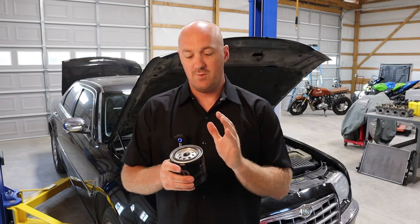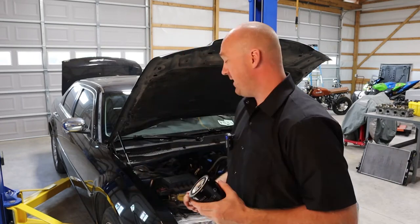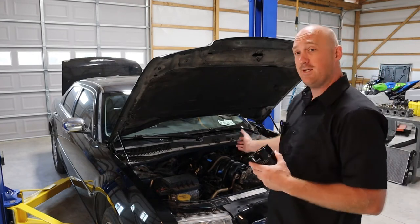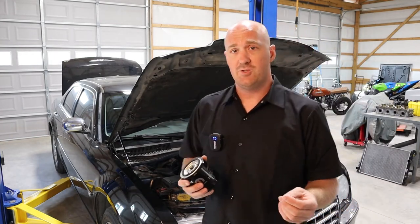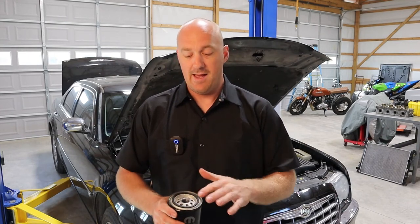The situation when you do need to add oil to this seal is if it's going against a completely dry machine surface. Take for example my Chrysler 300 right here — I've had this engine completely apart, you can watch that entire series on my channel. I've had this engine completely rebuilt, so it is 100% dry except for engine assembly lube, there's no extra oil in there at all. Therefore the machine surface where the oil filter meets up is completely dry, and I will absolutely be putting some oil on this O-ring before I install the oil filter.